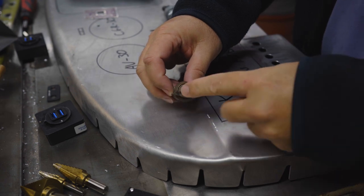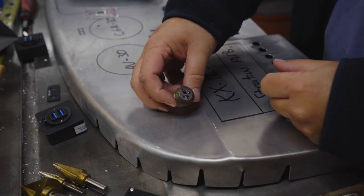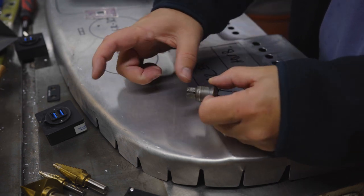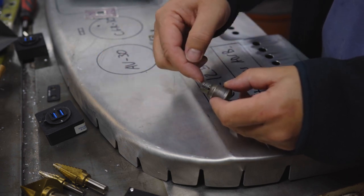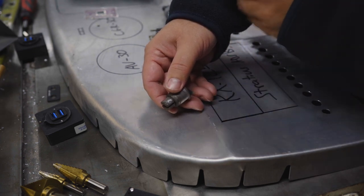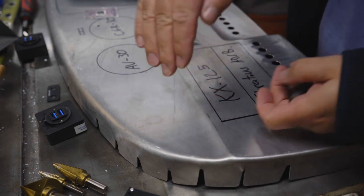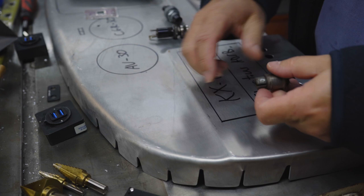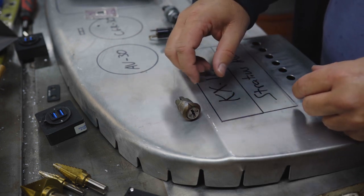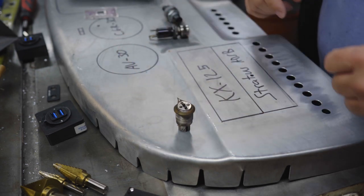Alright, so this is the front central piece, the key mechanism of the switch, the magnetos. On my plan, I think it's original, and I thought it would be fun to keep that. There's a big old fat piece about 2 inches in diameter that this activates or changes, which determines which mag is switched on and, hopefully, if they're switched off. The side of the fuselage tapers in toward the nose, so clearance back behind this thing is important. I've decided that I want about 1.5 inches of clearance from the edge of the panel to this switch.